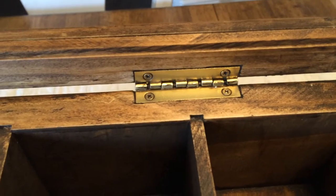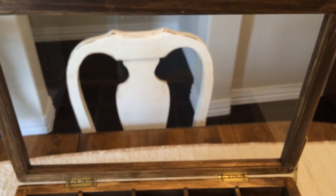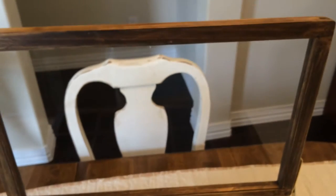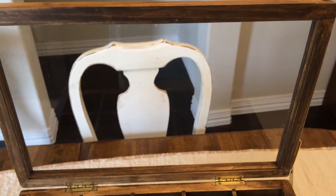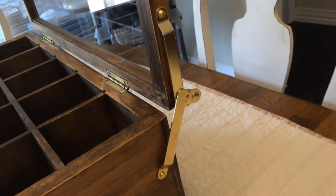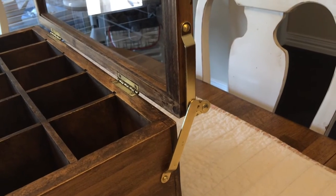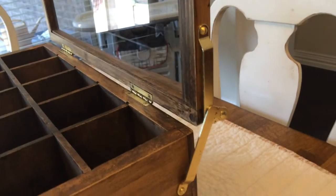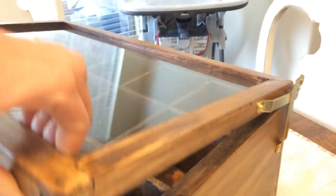For the hinges, there are two hinges here. I used stop hinges, which were still not strong enough once I had the glass in — that glass adds a lot of weight. When you're just holding the pane of glass in your hand it doesn't seem very heavy, but once you add it to the actual product it does. So here is the lid support — it doesn't quite lock into place like it's supposed to, but it works well to keep the box open and keep it from slamming shut.